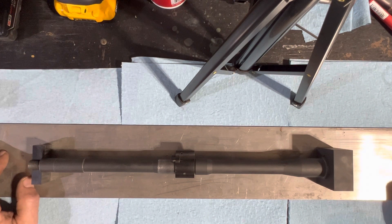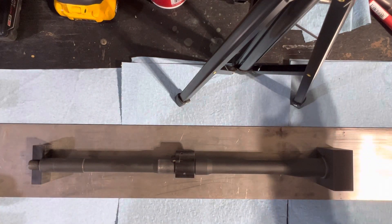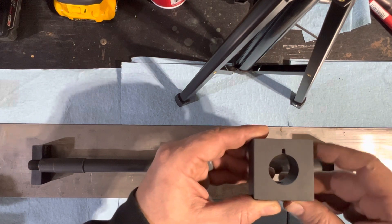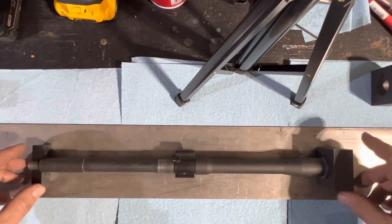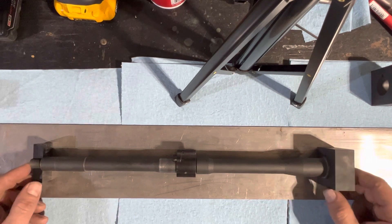If you have a drill press or a benchtop mill, there are other options. The simplest is: if you have a drill press and a vise and a way to square things up, you can just line your spindle up with the pilot hole and go. We make this rear block — basically the same keyed block similar to what's on our FSB jig — which makes that setup simple. With a piece of flat bar and our muzzle support block, which has half-inch and 5/8 half-moons to support the barrel at the right height, the setup is straightforward.